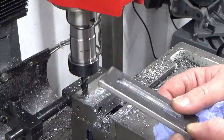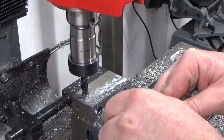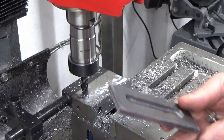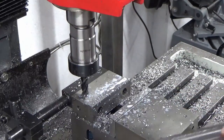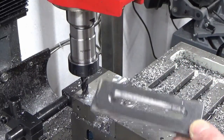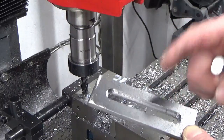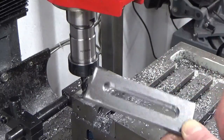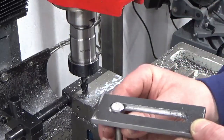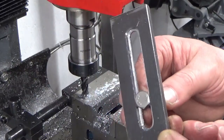So I know on my blether video, I don't know what came over me when I was roughly designing this, but I talked about using a countersunk head screw for this and making this a countersunk slot. But then the more I thought about that, I thought, well, once this is captive up against the side of the extraction spout, there's going to be nothing stopping the head of the countersunk screw spinning. So we've opted for, that's perfect, that's fantastic. So I've opted for a slot.